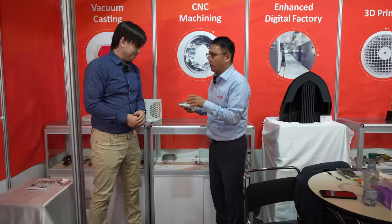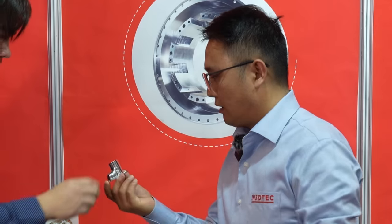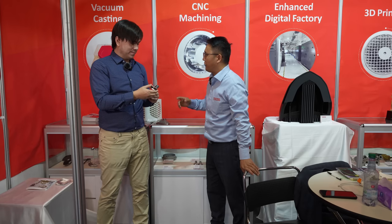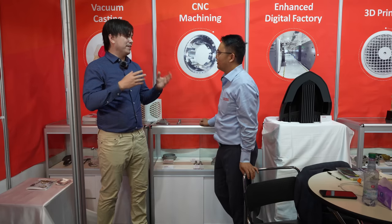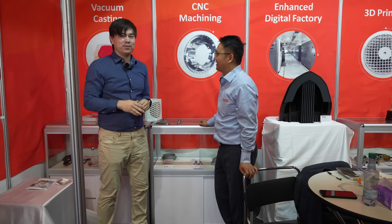In 3D printing there are multiple surface finishes, like sandblasting, glass beading, polishing, and also powder coating. This one is glass beading. This one is mirror polishing — it can make the surface very smooth. Are these typically polished by hand? Polished by hand first, then by machine. It not only makes the surface shiny, but it can also make the strength better. I used to work in a fatigue testing lab, and one thing that is really important is the surface finish. If you have a really rough surface, those are potential sources for a crack to start, and it propagates and the whole thing fails.